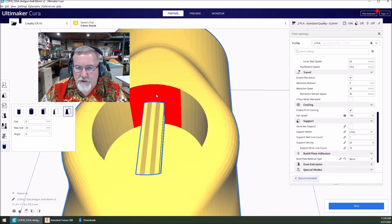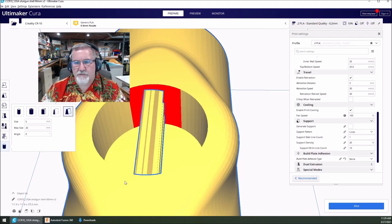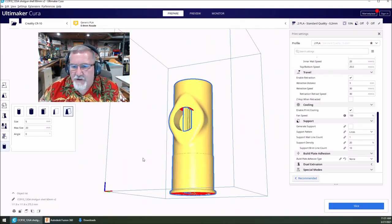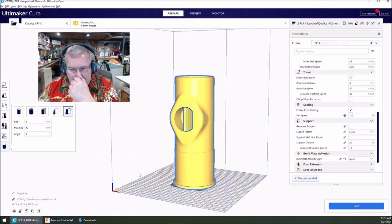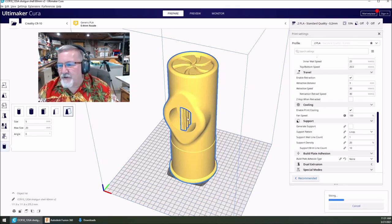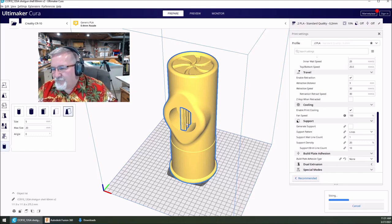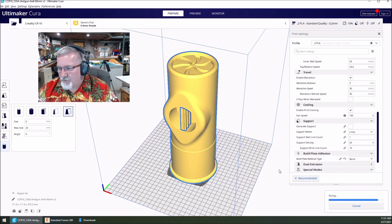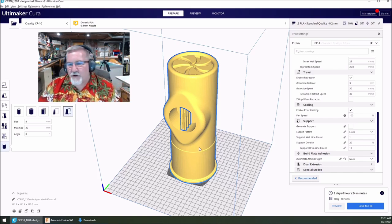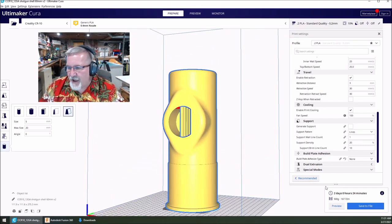Pick a surface — here's where you can design whatever kind of stand you want. That was close to 84 millimeters for the inside — that's one circle. Depending on what wall thickness you want on your stand, you can do 104 — that gives you 10-millimeter wall thickness; 104 minus 84 is 20, so 10 millimeters thick. Create yourself a line across the midpoint. This will give you the idea of how I built the stand you saw in my picture.